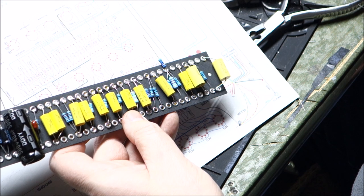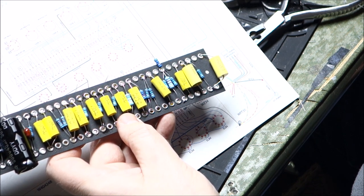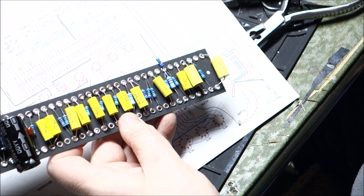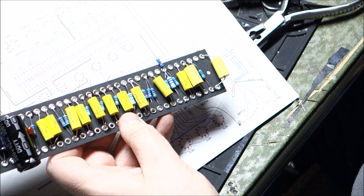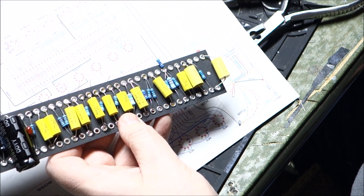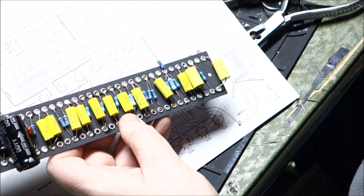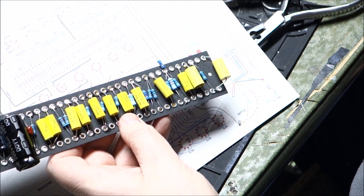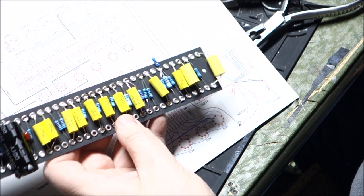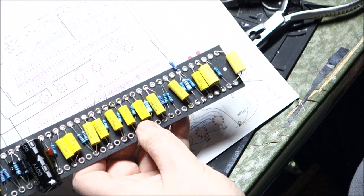And as far as the resistors go, some of them are the 3-band, 4-band, 5-band, whatever. So if anything, use your color chart to get the right idea. And then once you've sorted out the few that you think are the right ones that go in there, check them with your meter. It's okay. It won't hurt. Capacitors and stuff too. If you're ever iffy on it, just check it first. It's easier to check it now than it is to desolder it and curse the sky a little bit later.